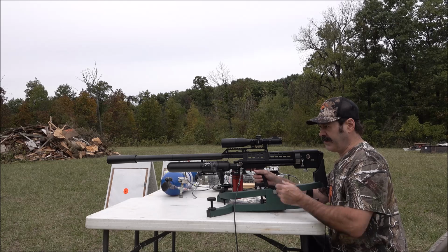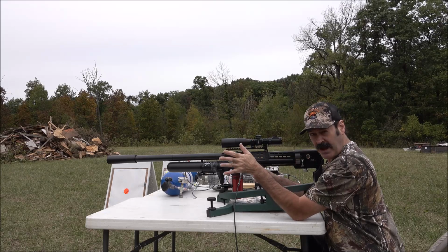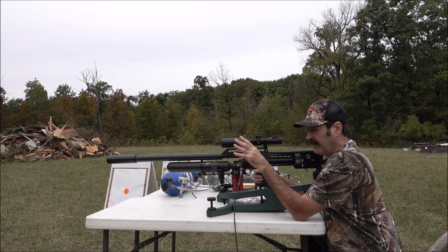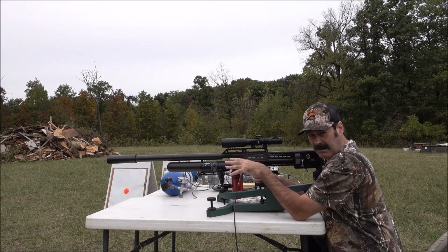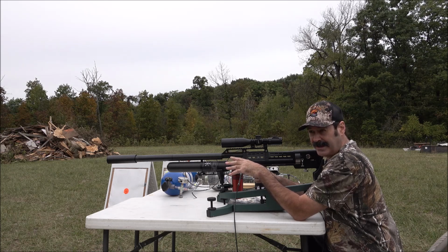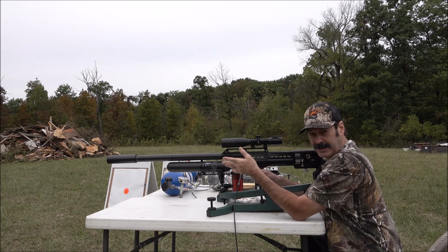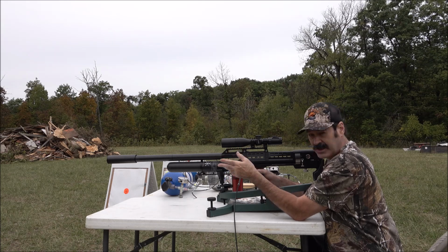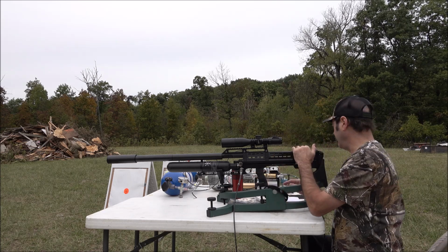The other thing is I'm going with a slightly smaller bore diameter. I'm doing about 4.54 at the moment, because I noticed, and I think I mentioned in an earlier video, with the 4.56, 4.57s the speed is slowing down, and I don't want to lead the barrel up. Again, people have a tendency to shoot 300, 400, 500 bullets out of this, and then it's like, hey, my accuracy's off. It's because you didn't clean the lead. You're just packing the lands and grooves. So, as always, every 50 bullets, scrub your barrel, safety first, so that's what we're going to start with.